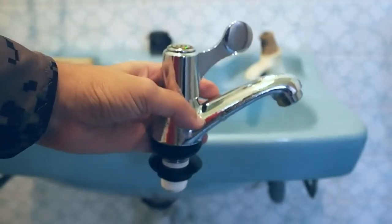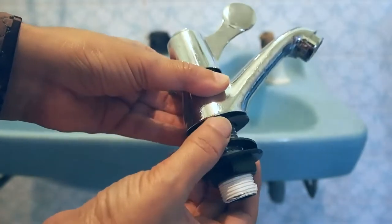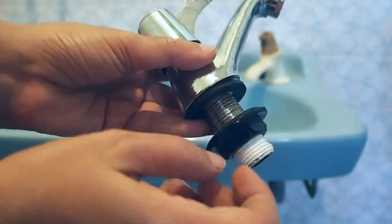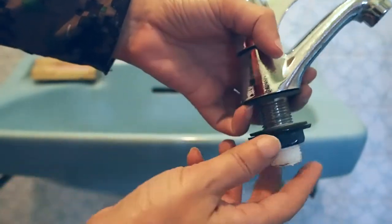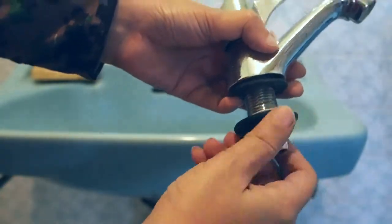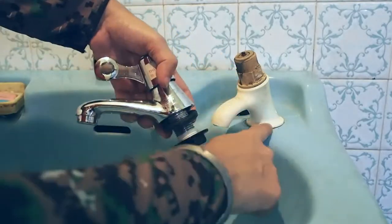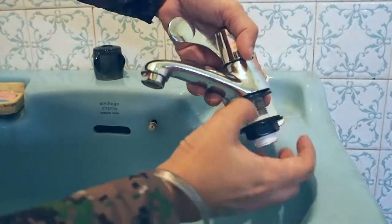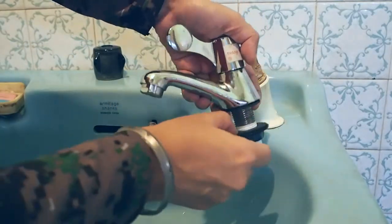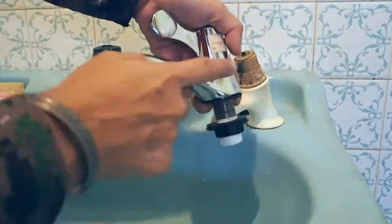This is the tap unit that I'm going to be changing to. You have these washers at the bottom here — they're rubber washers, and there are two here. Some units have only one. Then you have this nut at the bottom. This part will go on top of the basin and this part is going to go on the bottom of the basin. Since we have two washers, one will be on top and one at the bottom, and then you just tighten it in place.